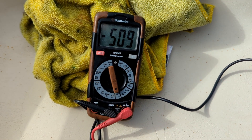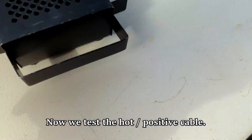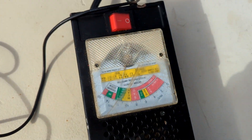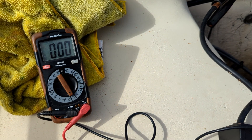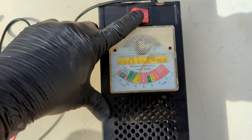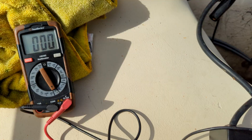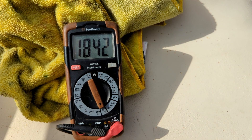Let's go ahead and load this thing up. It's telling me continuity but giving me 500 ohms - and I'm testing on the hot side. You can see the battery switch stud looks like it's been kind of blown off by some sort of surge. Checking the hot side of the cable with an amp draw on it - first our voltage drops off, you can see voltage is just going through the floor. We've got continuity with no load, but now with a load on the hot side it looks like we've lost continuity.